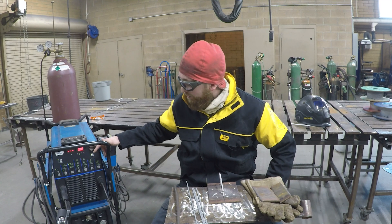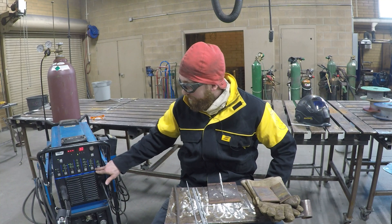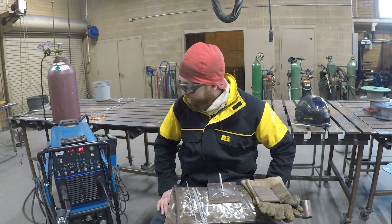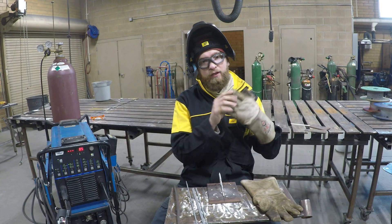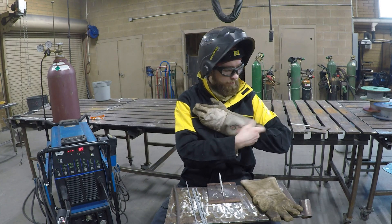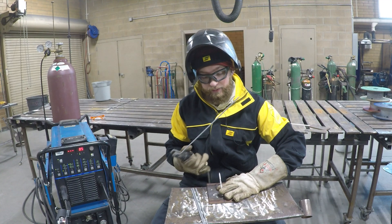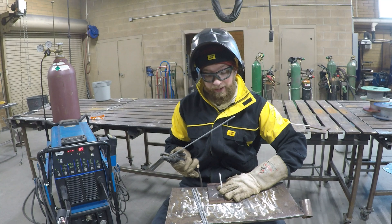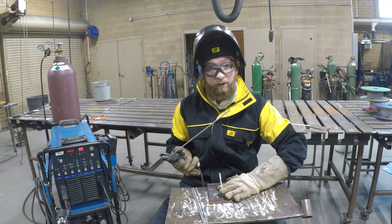For tacking, I'm going to start at about 85 amps, and also make sure that our dig — the adjust button — is up to 70. Hit the main amp button and go back. Make sure your helmet's on, and get your big stick welding gloves on. Do not use your skinny gloves. I'm going to do my best to make sure these plates are flush to each other — I don't want one end higher or lower than the other. Having a nice ground-down table, which you should do at the end of every class period, is really helpful.